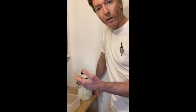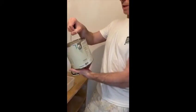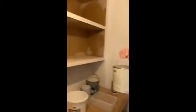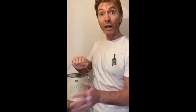Now usually, ideally for painting these shelves, I'd use an eggshell finish — that is what I would normally do but I don't have any. But what I have found is a tin of wipeable emulsion in the correct colour. What's the colour? Gray Sealed. Correct — Gray Sealed. It's the same colour we did the outside of my daughter's room and she wants the inside done this colour. So I'm going to paint the shelves with wipeable emulsion. I know you're not strictly supposed to — it's meant to be eggshell because it's more durable — but that's all I've got.